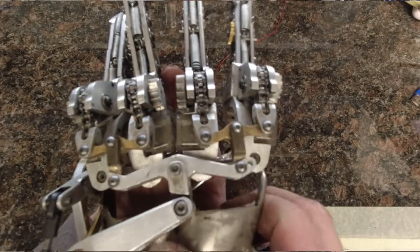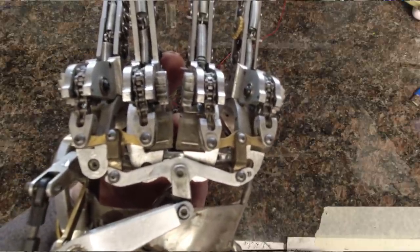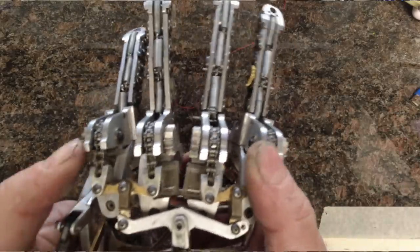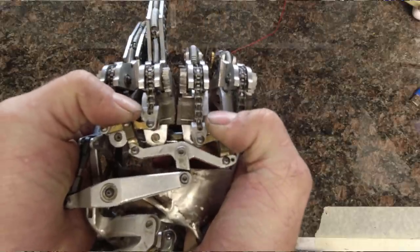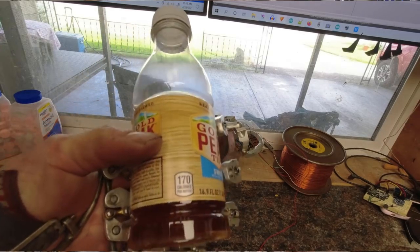Let's look at the whiffle tree assembly. Accuracy is super important when laying out this assembly — being off just the slightest amount is going to make it so the fingers don't open and close at even rates. The whiffle tree is a balance beam. If both sides aren't exactly the same length from center to center, then the fingers will end up closing at different times. I employ that feature primarily on the pinky — the pinky linkage is the shortest, only by a couple thousandths, but it is slightly shorter. This is so that it closes first when the hand cycles. I have the hand set up this way so that when I pick up and hold a glass, the cup posts on the side of the pinky, keeping it in place while the other fingers just hold the glass against the palm. It also helps with the lifelike appearance of the hand. With the natural hand, you don't usually close all the fingers at the same time — you kind of fan them. And where I've been able to do that with my prosthetic, it really adds to the natural appearance of the motion of the device.